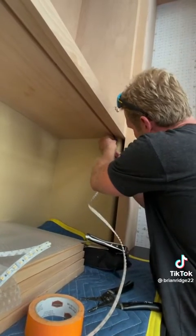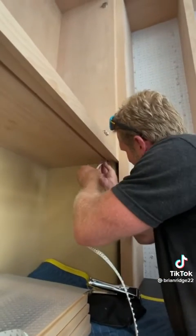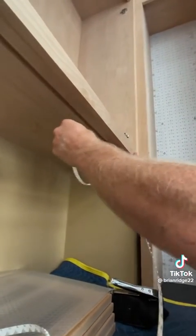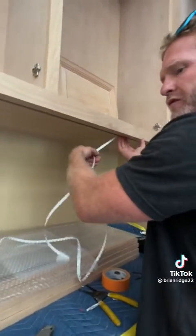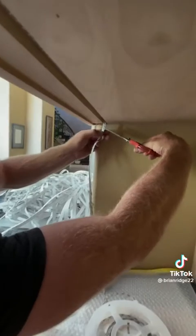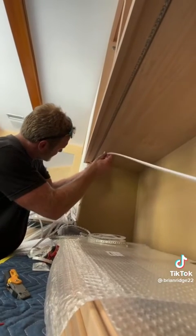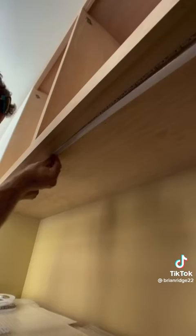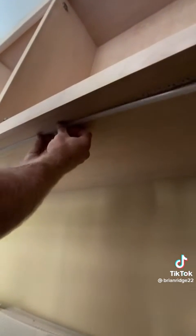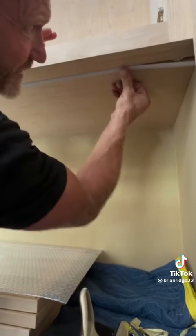I finished installing the cover, wired my LED tape light, and I'm going to push my connections up into the cavity, pull off the double-sided tape, and stick it into this groove. After cutting it to size at the end of the groove, I'm going to install the lens on top of it. I'm cutting it on the mark where it shows the scissor, and now the lens just snaps up into place — making sure you get both sides in at the same time so that it's nice and straight on the wood.